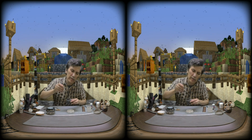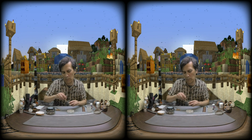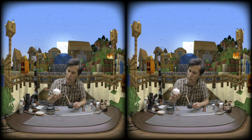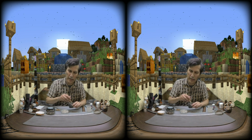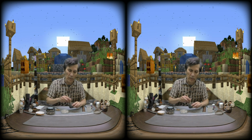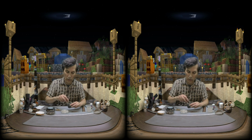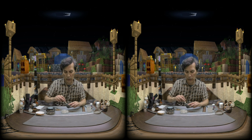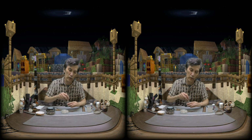So you're going to get a consistency like this. Now it's really thick. We're going to be electroforming these. We're going to turn these into copper. So we want a paint that will not necessarily be too thick. That way you can see the lines. But if it's too thin, then it will break, and you may need to do multiple coats. Just depends on your application. I usually like to do everything in one application if possible. Especially if you're doing a production run. So if you needed to make like 40 or 50 of these things, then you really want to save on your time.